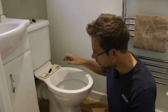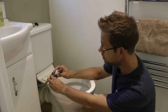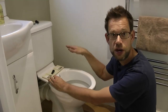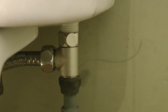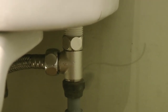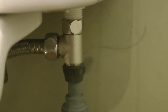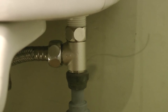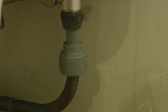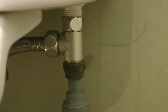I've already started on the plumbing. The reason I haven't featured all of it is because it's different for every installation. You've got this plastic connector that attaches to the seat itself and a flexible braided hose going into a T-piece. Every toilet in our household has a little white threaded bar hanging out the bottom, so the T-piece simply screws in between that and the water connection coming into the toilet. It took me a couple of hours of faffing to get it sorted, but it's in there now, not dripping — good seal — so the water side is complete.